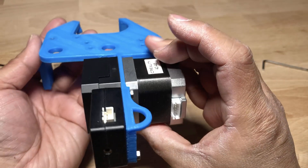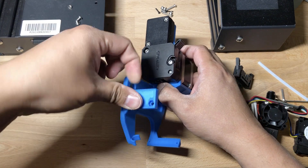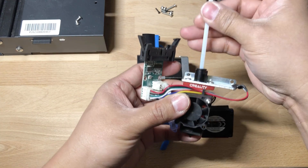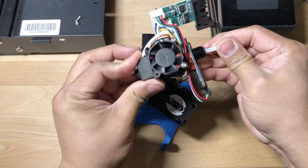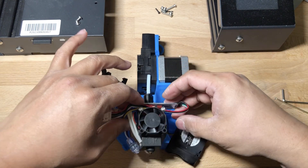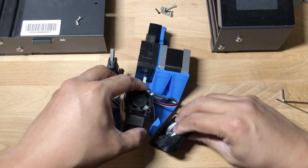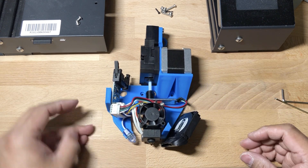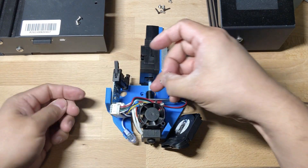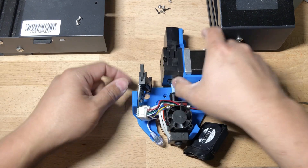Once these three parts are in place, everything is a lot easier. Put your M3 nuts in on the left side of the mount, pop in the Bowden tube, and position everything into place. One thing to consider during positioning is that the cable for the fan needs to go around the back of the mount. Then take the longer screws — which you could replace with 8-millimeter screws — and screw the connecting board in place on the left side.